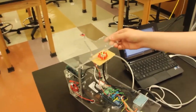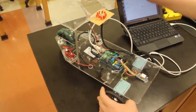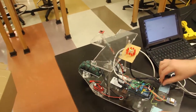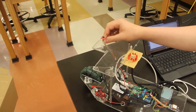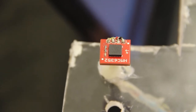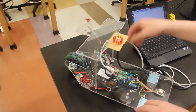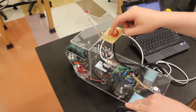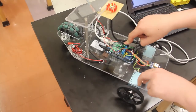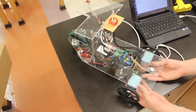Here's my GPS-guided rover. There are a bunch of different parts that come together and make this thing work. Right on the front is a digital compass module that needs to be far away from the motors because it's highly affected by any magnetic fields, so it's mounted up here facing right toward the front of the rover. Right behind it is a small LED indicator that displays direction, so as it's trying to turn, it'll light up a specific LED to indicate its target. Then here's the actual Arduino, which stores the code and makes everything happen, and on top of it is a motor controller that drives these big motors.